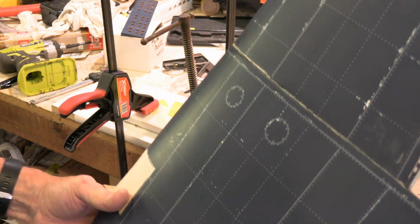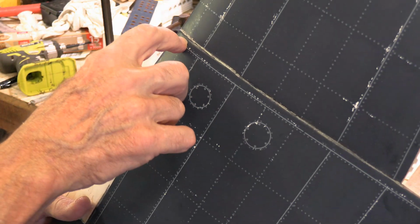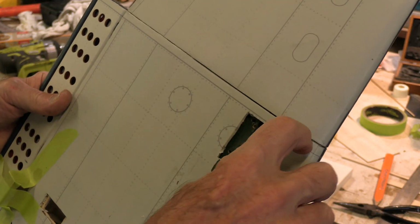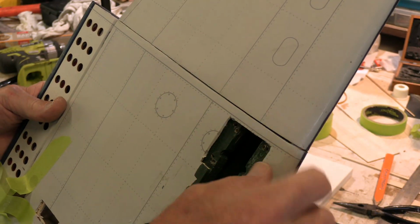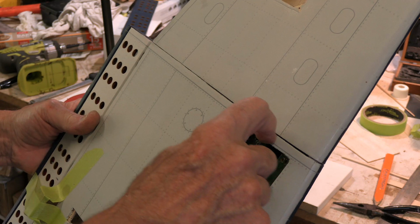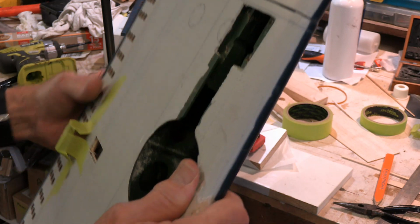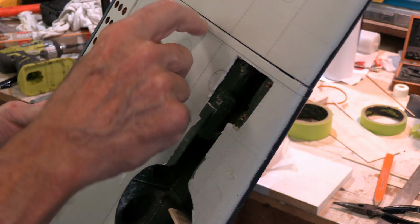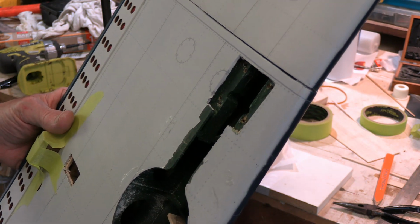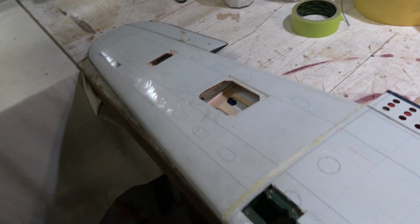Just looking here at the wing that wasn't broken, I see some gaps in here. I see a bit of a crack between the glue and the thing there. On the back, there's quite a large area that doesn't have any glue right up to the edge. And of course, through normal positive G's, that's got a lot of stress on it. Of course, it's still got the joiner in place in there, but I think I'm going to just add some glue into this, similar to what I did on this other side, and just try to improve that a little bit.